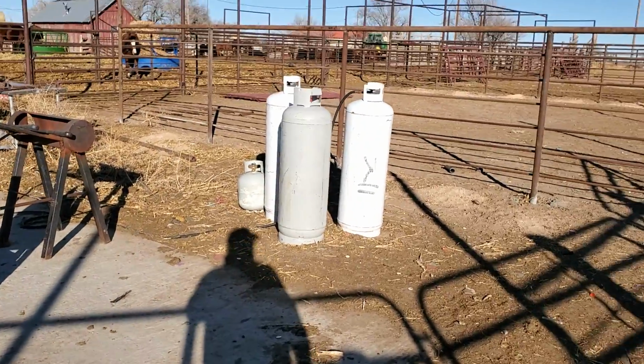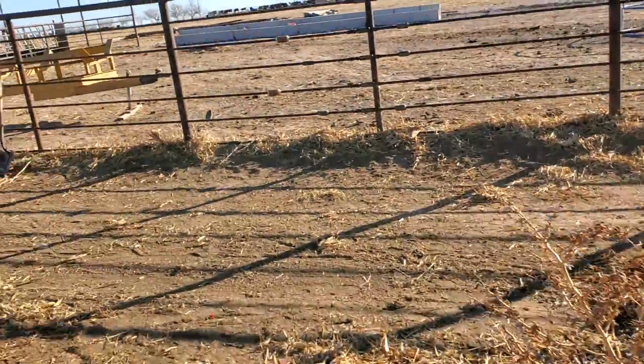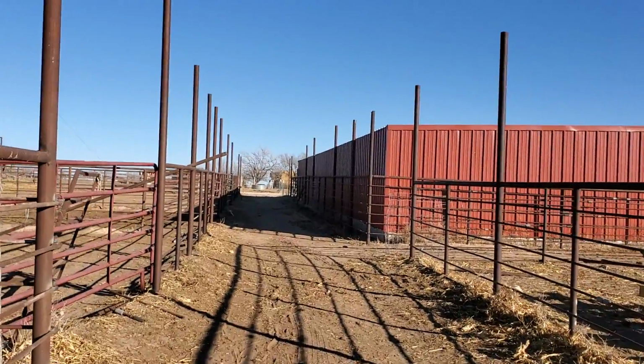As far as the materials on it, we're just going to use 4-inch post. I think they're 4-inch. I'd have to go look at all this stuff sitting by the road. 3/16, and then just I-beam. I'll make a video on it as we put it up, and that'll give you kind of an idea. And then just C-channel for the walls and Z iron for the purlins, which I have some of over here. But you don't have to get real wild on these things, and they work just fine. But that's what I do on my fences.